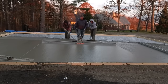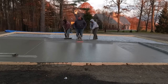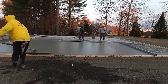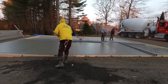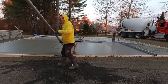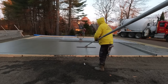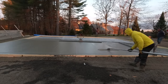You may only pour out a bay. Luke's running the battery screed right now from MBW — the Screed Demon. About 12 feet wide by however distance that is — that's a bay. You may only want to pour out one bay, get it screeded, pour out your second bay, get it screeded. If you have more concrete left on the truck, pour out that last section and do it in smaller sections if you're kind of new to this. That way you don't get too far ahead of yourself, especially in cold weather with accelerators in the concrete — you only have so much time to get it down before it starts setting up on you.